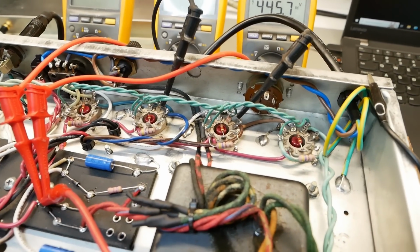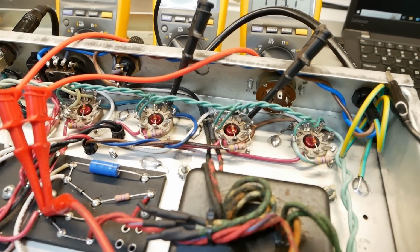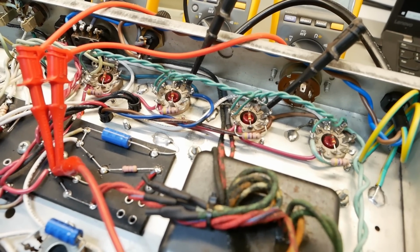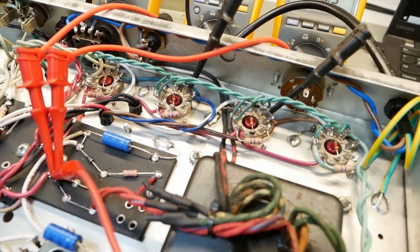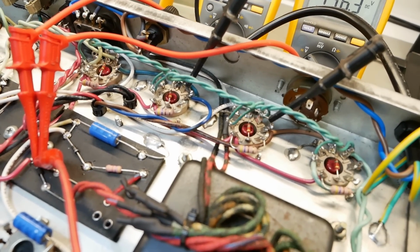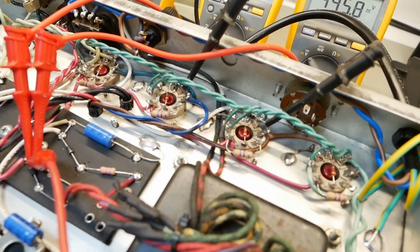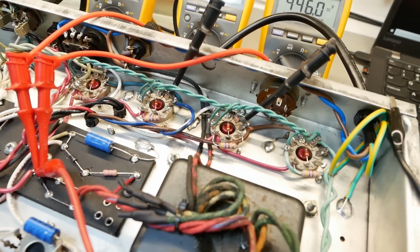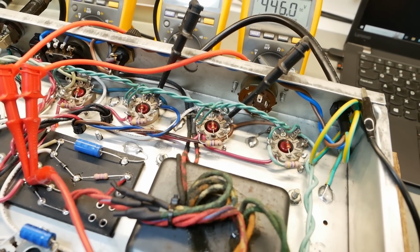Now there is some very slight microphonics happening in the output valves and the Tube Amp Doctors. Tube Amp Doctor Red Bass were my preferred series for everything, but I've had, what, 4 sets now that have had microphonics in the output stage. So it's kind of a case of that's just as good as we're going to get these days, unfortunately.